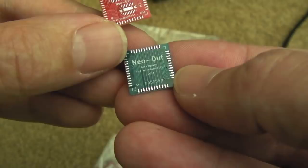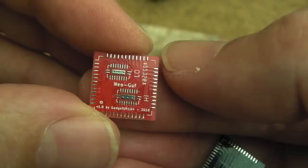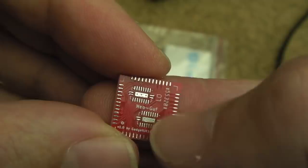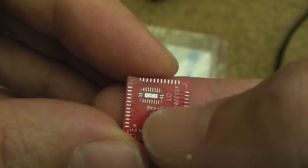And look at the size of the ICs I've gone for here. I'll show you them in a sec. It's going to be super hard trying to solder those on. My nails need cutting as usual. These videos always prompt me to go cut my nails. Yeah, I'll show you the chips. We'll try and get that on there. It's QFN type, I think the smallest version of QFN. So in theory, as long as we get enough flux on there, we should be able to drag solder around, and hopefully get the chips on.